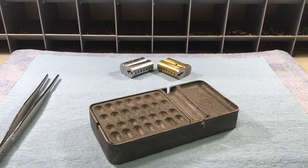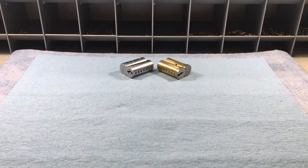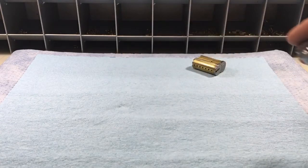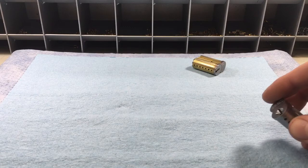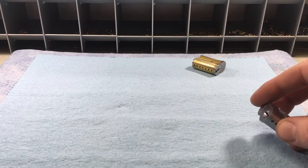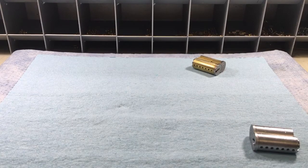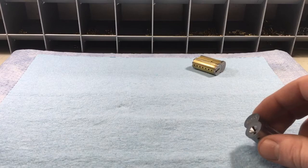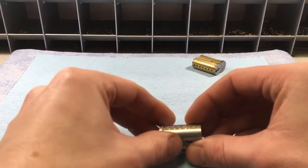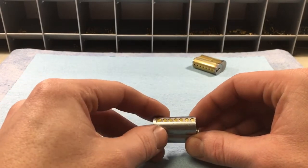A few items you're already going to have — for example, tweezers. This pair is by Lab and it's specifically made for small format pins, which have a smaller diameter than traditional pins from Ilco, Sargent, and other manufacturers. You can use a general set of tweezers; these are just better suited for small format because they're machined for that smaller diameter, giving you a snugger grip. You can also use pinning blocks for decoding.